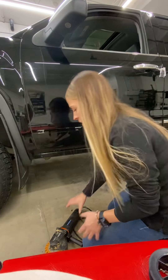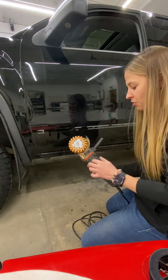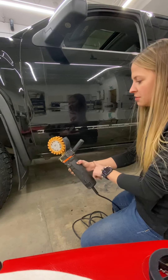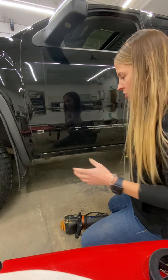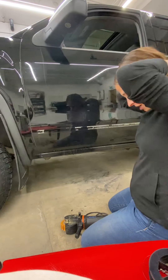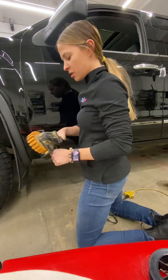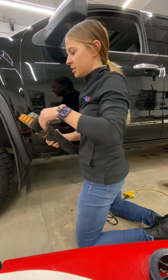Then we're ready to grind. Make sure you check out the video on the grinder itself — how to turn it on, how to hold it, and all that. For now, the quick rundown: make sure you don't have any long sleeves that could get caught in it, and tie your hair back. Keep your hair out of the way — you don't want it getting caught in the grinder. To turn it on, hit the button on the bottom, it flips up, and then it clicks in.